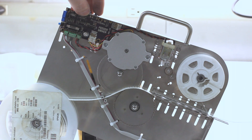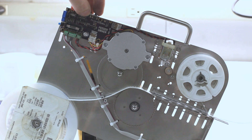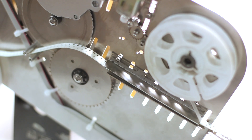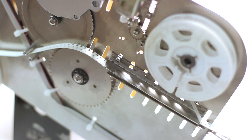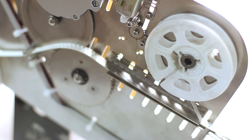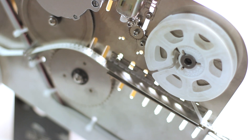Typically these push buttons would only be used to assist in getting the tape through the guides on the feeder mechanism, and you'd want them to run continuously for that type of operation. Right now we're just using them to demonstrate the feeding operation — we haven't even gone through the trouble of calculating the number of steps required to advance the tape by one position.